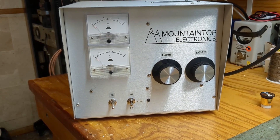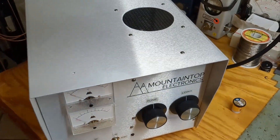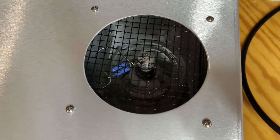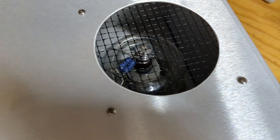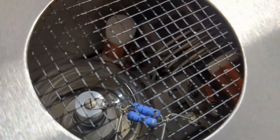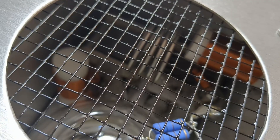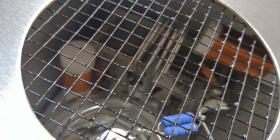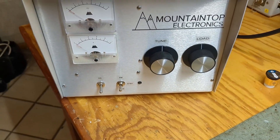Boy, this box is really getting up without a lot of drive — kind of cool. If you're a serious operator and you know how to not beat it up, it has forced air cooling. It actually has a centrifugal blower on the other side. It's got a glass chimney — you can see inside a little bit — blows up and around the tube. It's got an actual air socket. This is a very nice build; this box really came out nice.